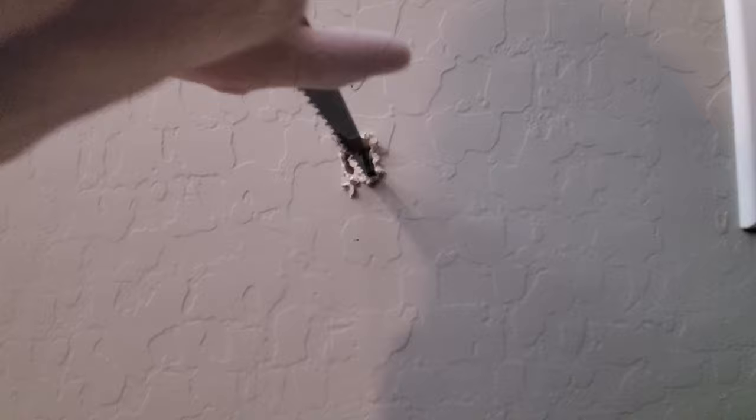When you remove drywall, less is best. Take your time and shape around the area you want to remove, then test it with the wall plate. If it's not big enough, gradually remove more drywall until the back of the wall plate fits in the hole and the wall plate sits flush against the wall. And it fits perfect.